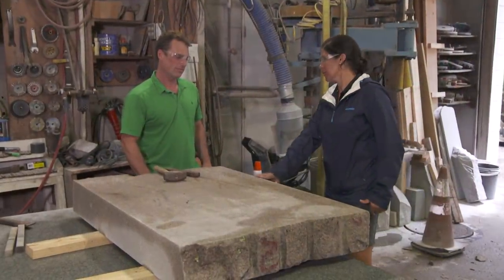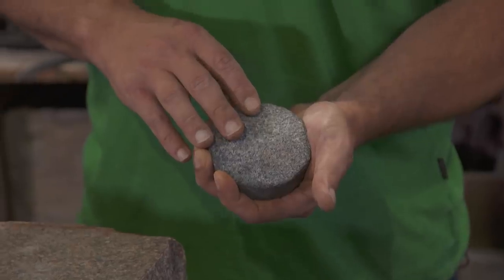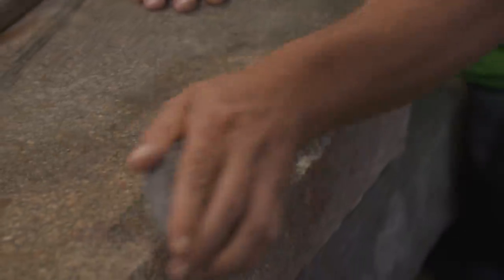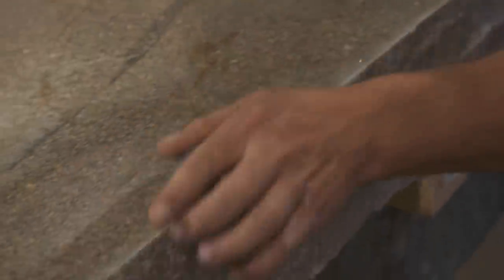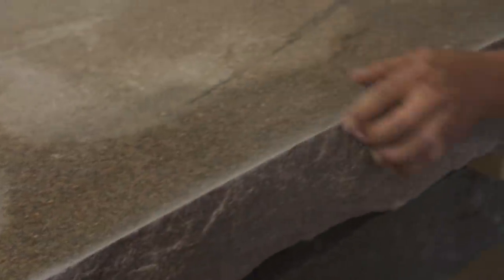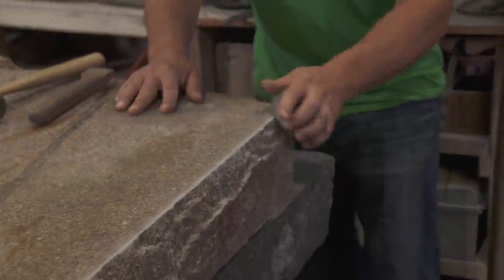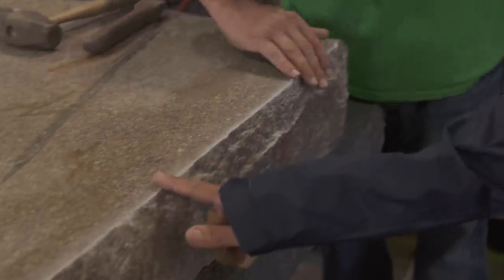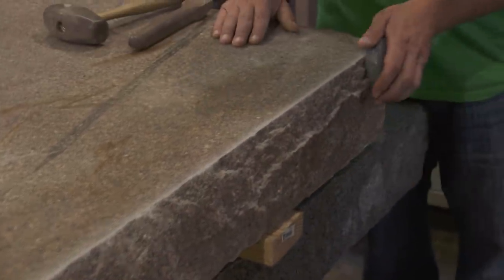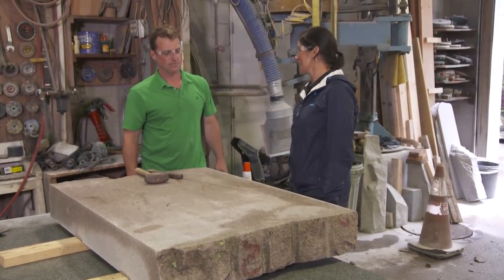This is definitely sharp. What we have here is a pumice stone. That's going to get rid of that sharp edge — take it on the edge, go in a circular motion all the way down. As you can see when I'm done, it's knocking that sharp razor-like edge off of there — we're just rounding it off very slightly. Now feel that. Does it feel a lot smoother? There's no jags. That works perfect. So we just have to rock face these two sides. This is the first finished edge, and six more to go.